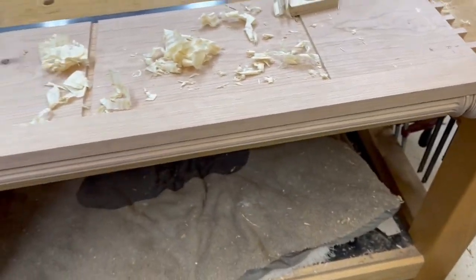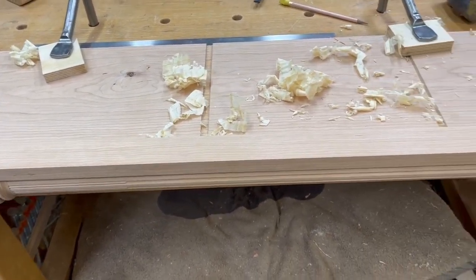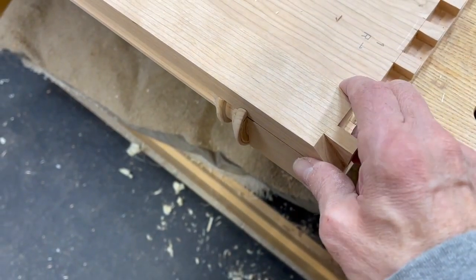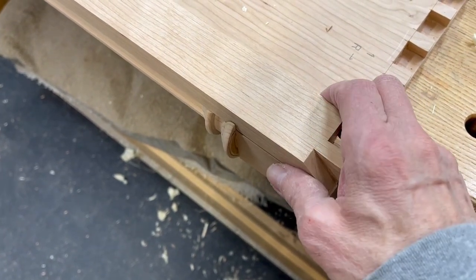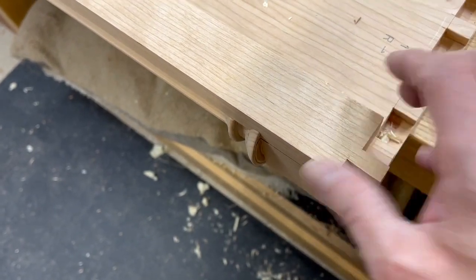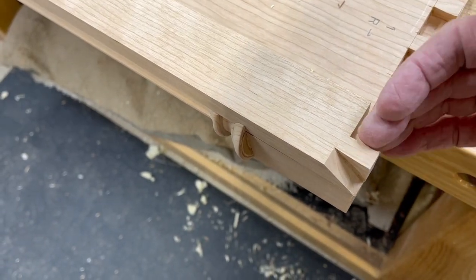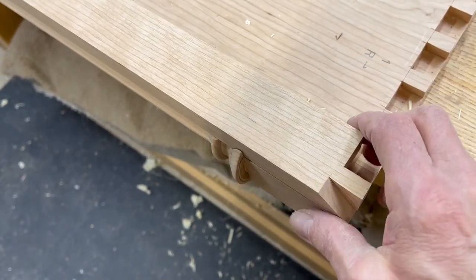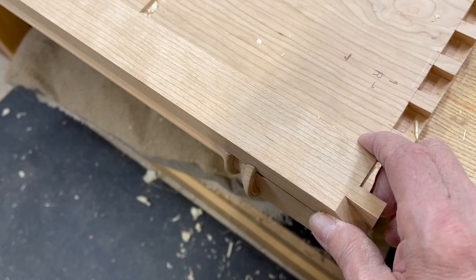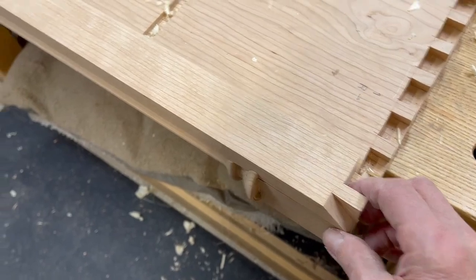All right. I was getting ready to glue the top and the bottom, and I realized that I may have trouble putting on this side piece, or it's not the side, but it's the front face frame. We got these little lips here, so I can't slide it in that way, and the bottom is going to be up against this, so I can't go that way. I can maybe have wedged it between top and bottom and got it in there this way, but I thought it probably just would be better if I went ahead and glued these on next.